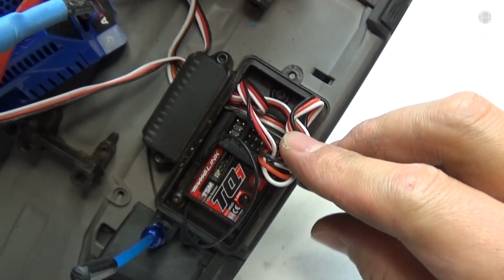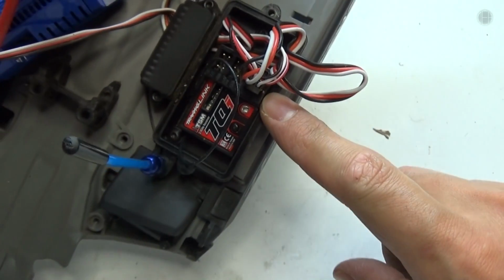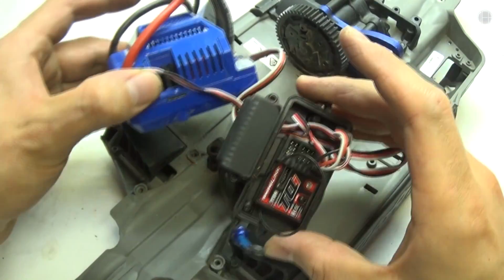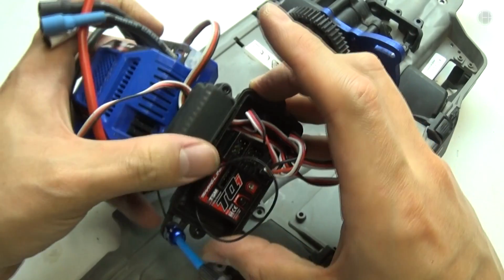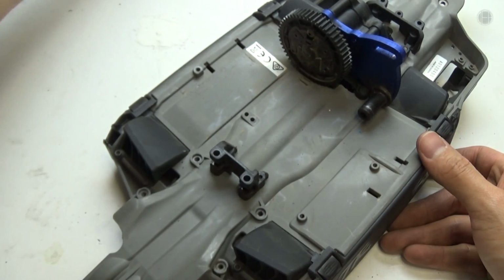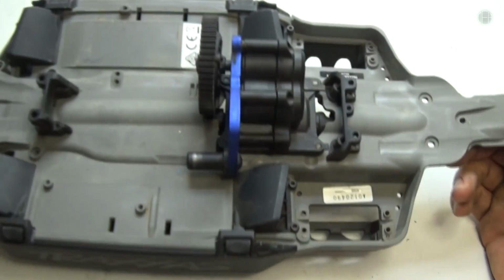And the last step is to go ahead and take off the receiver box cover by undoing the 2 screws that are inside. Now I can take all the electronics, set that off to the side, and I don't have to remeasure all the wires. Believe me, that's going to save some time putting all this back together.